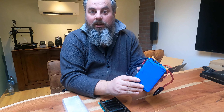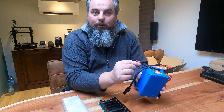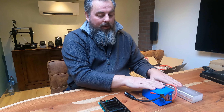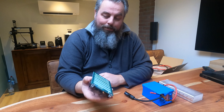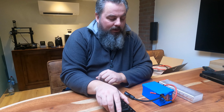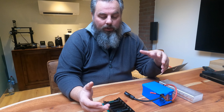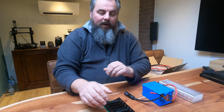I showed you the Battlematic. As you can see, one battery pack is a parallel pack - this is not a pack that goes in series. The same for the majority of trace fused or battery hookup battery packs that are using those nickel strips. One pack is just 4 volts, and then you start daisy chaining them together, making a 14S or larger. And then each pack has its own balance lead.